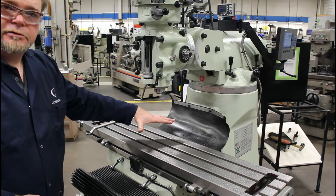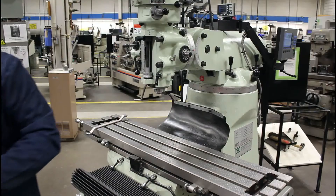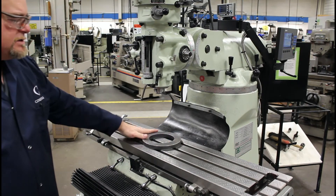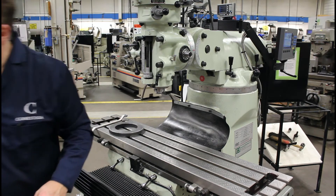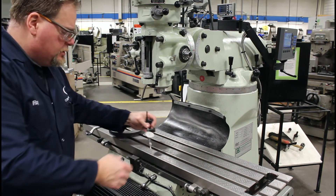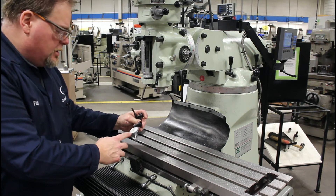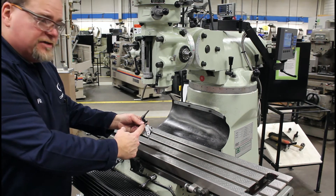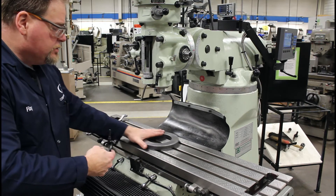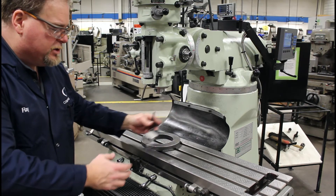The five-inch ring can also be mounted in a vise so you don't actually have to take the vise off — just take off the movable jaw, set it on top of the ways of the vise, and then it can be indicated this way as well. A ring like this is nice to use; it's a smaller ring but that's still okay — works great. Why do you want to use a ring? Because every time you go over top of your table you're going to get a click on, click off. What it does is it shocks your indicator. A lot of these indicators now will say shock proof, so it can take a little bit of abuse, but you still don't want to do it because it's very fine gears and fine springs inside your indicator. Running across a ring gives you a nice smooth surface and you don't get the issue where your indicator won't repeat because you've hit it too hard.